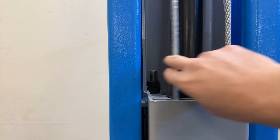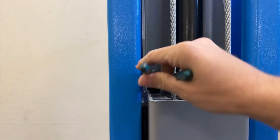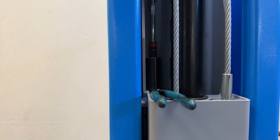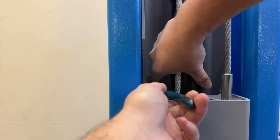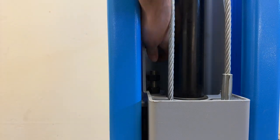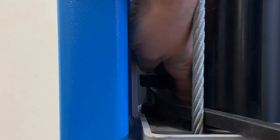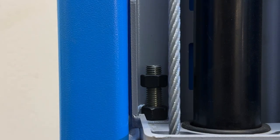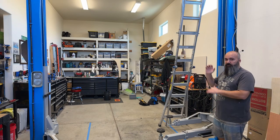What we need to do is get our channel locks on the lower nut because it's fairly difficult to get a wrench in here. Then we're going to drop our big socket — this is an inch and a sixteenth for me — and an extension over the top of our ram and break that tension free on the top lock nut. Now we're going to spin that top lock nut up, and this is where our pry bar comes in. Instead of trying to hold the cable from underneath or from up top, we use our pry bar for leverage and spin that nut down to get the appropriate tension. About an inch is what we're looking for — check that on both sides. Before we torque our lock nuts down, we're going to run the lift arms up and see if our adjustment is good one or two times, then we'll lock everything down.